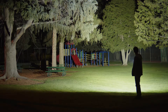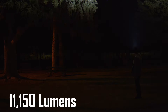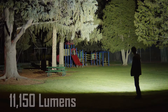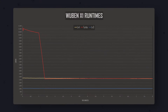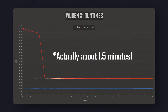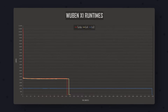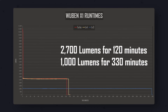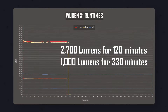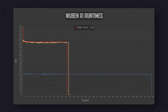The performance of this is excellent. Three XHP70s, 11,000 lumens. The driver has really good regulation. Looking at the runtime graphs, we start at just over 11,000 lumens for about 45 to 50 seconds, then it drops down to a sustained level of 2,700 lumens for another 115 minutes, a little bit longer on high. Regulation is excellent across the board — totally flat with nice long runtimes. The performance here is very good, especially for something so compact.